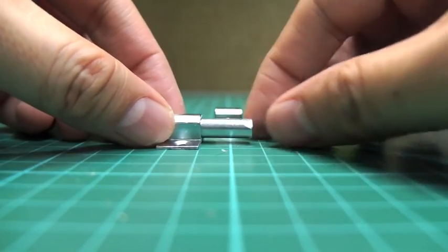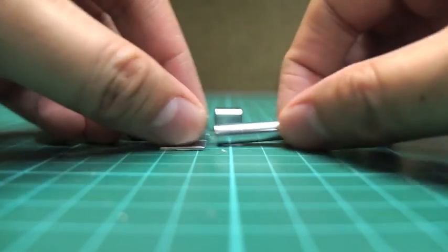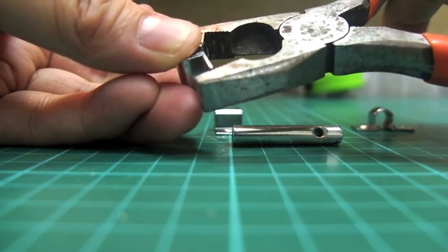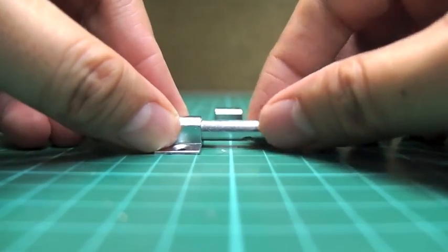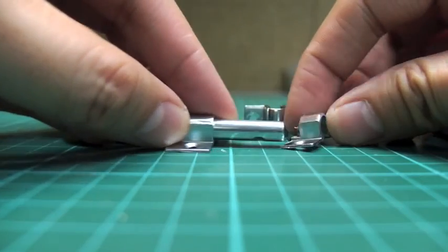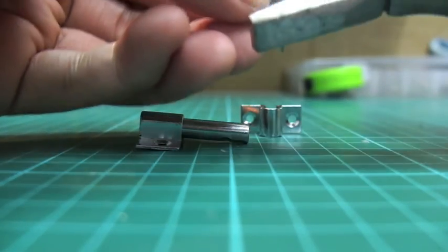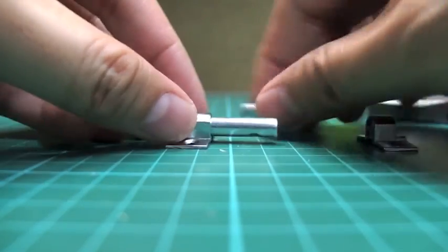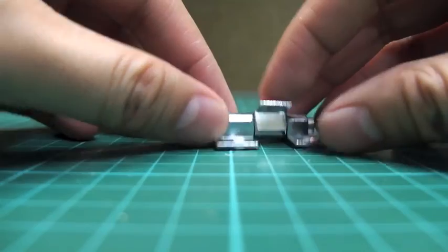Here's something that happens with these: the center spine or axle actually has a lot of play. You take that out by getting your pliers and pinching these tabs right here together, making a smaller hole and a tighter fit for the bolt. And there you go — no more play. This side is pretty loose too, so I'm going to tighten that also by squeezing it in.